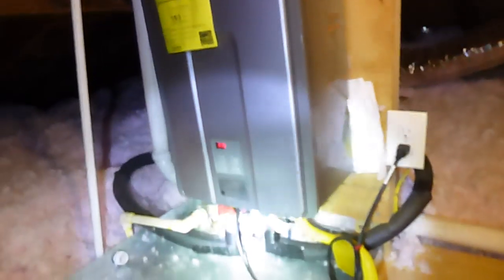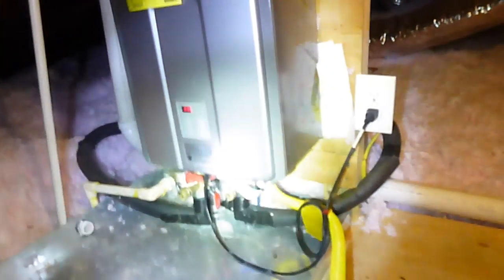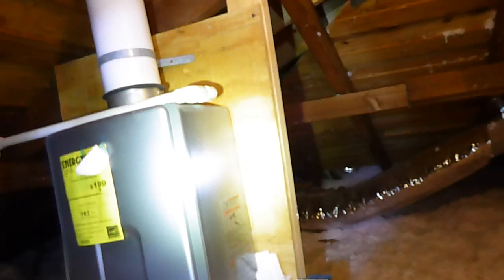We've got a little reunion. Tankless water heater. Has a safety pan. I really appreciate that. Thermostat's right there on the water heater. It says 115. It shouldn't be more than 120.